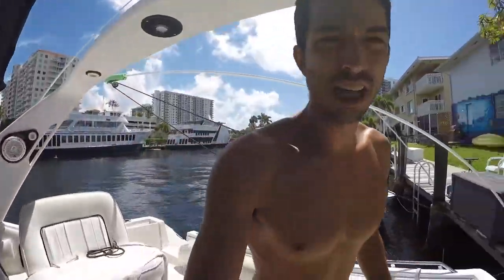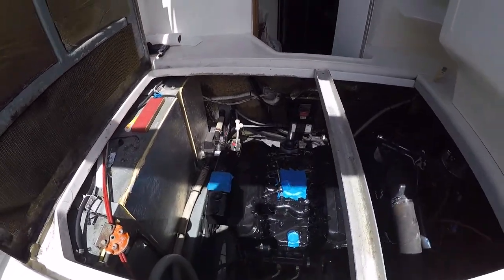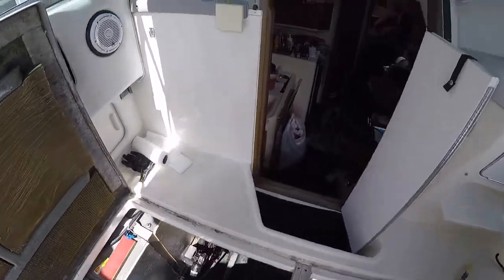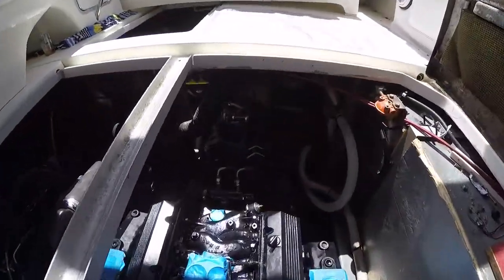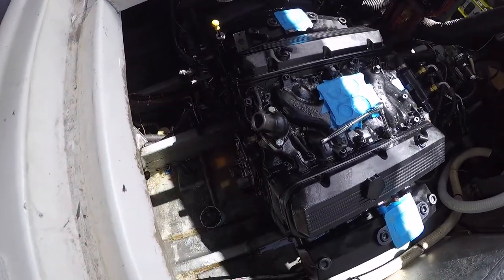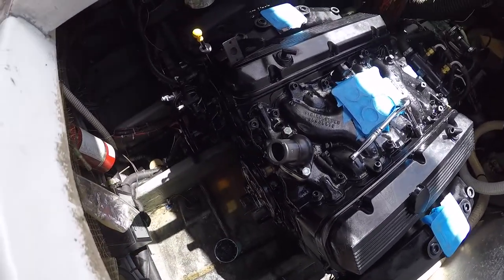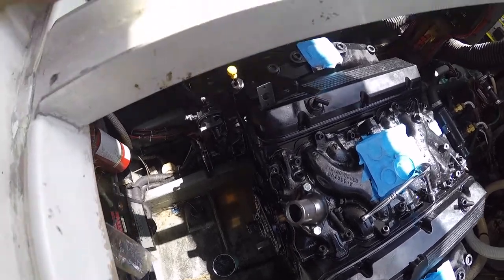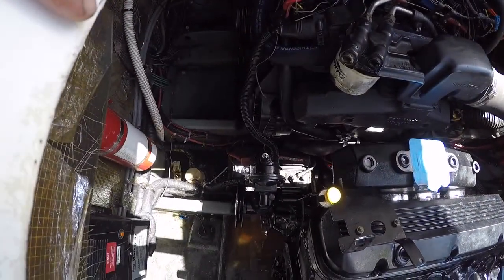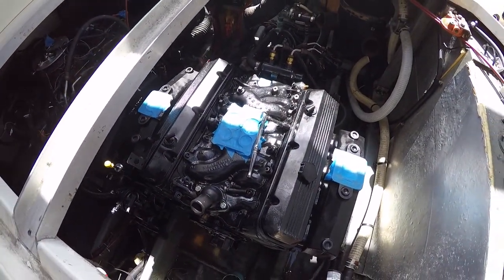Here at Cruising the South, we share with you guys all the awesome places we go with the boat, but also all the problems, services, and solutions we come up with, right? And of course, we are in the middle of switching out our engines. Last video I showed you guys how I dropped her in and how I installed all my cooling system for my oil. Now I'm about to install the fresh water cooling kit for this bad boy. First I have to slap on the alternator, then my circulating water pump, and I already installed my raw water pump and fuel pump right there. So let's get right into it and get this bad boy ready.